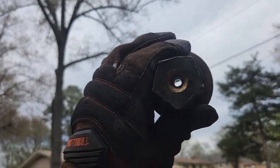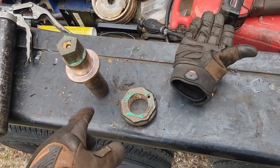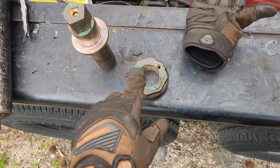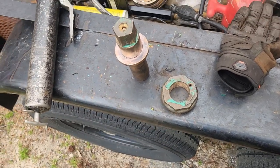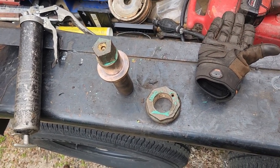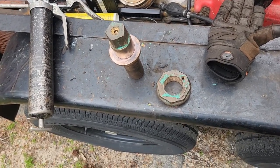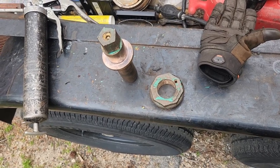Parts are all cleaned up. We're going to put a little bit of grease here, here, here — on the inside of the hold-down nut, a little bit on there, a little underneath, a little around here, and then some on the threads of the stem, and assemble it all back together. Just a little bit of grease — it doesn't take much. These hydrants need to be lubricated every single year, and if you do that every year they're going to continue to work really well for a very long time.